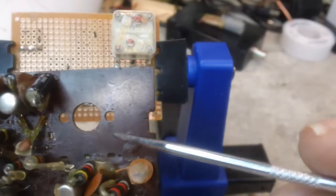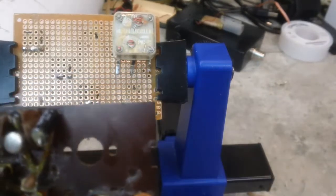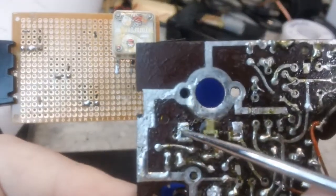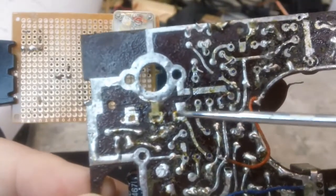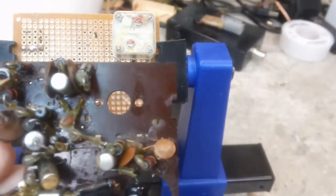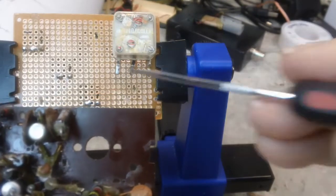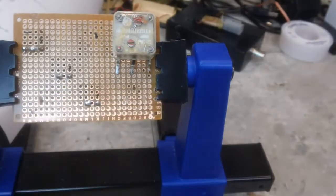And so that would mean this leg here, closest to the ferrite loop, is going to be the one that connects to that. If you look on the other side, this connects to the antenna. I do know that. So that means that this is the coil and the oscillator. If you look, it runs directly over here to where the coil was. So we have a good confirmation that we're there. So again, split it over like that. That's how it's laid out. And that means that the loop, or the antenna, is this, and this would be the oscillator coil. So that's where we need to connect it, and that's what we're going to do. So be back in a bit.